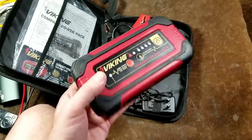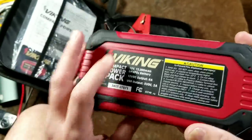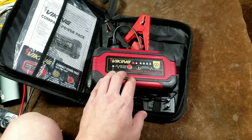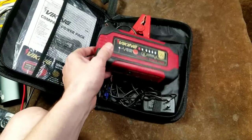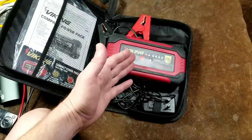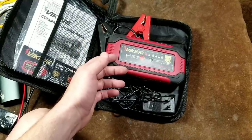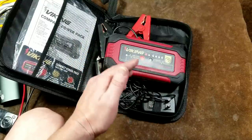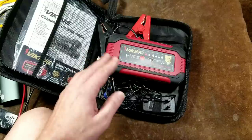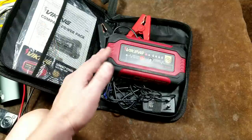This is a lithium iron phosphate polymer battery — 12 volts, 12,000 milliamp hours, advertised as 144 watt-hours. LiFePO4 batteries will actually deliver that — about 90 to 95 percent of that power in an hour. You could literally drive a 100-watt light bulb for nearly an hour and twenty minutes off this pack. A lead-acid battery rated at 140 watt-hours might only run that same bulb for 30 minutes.